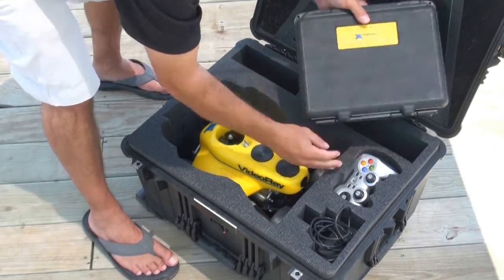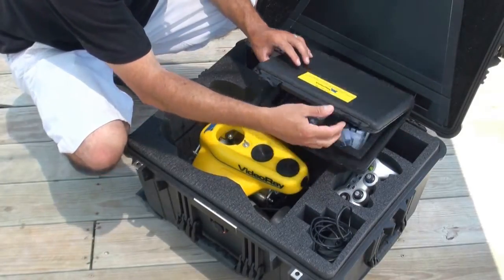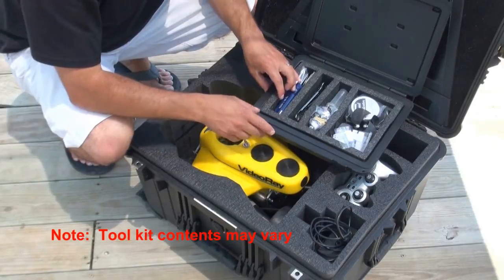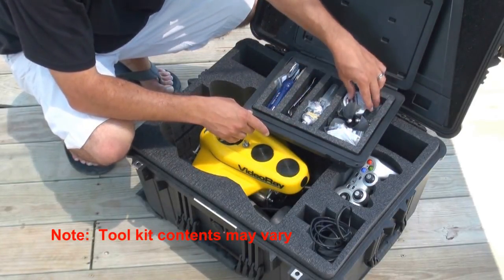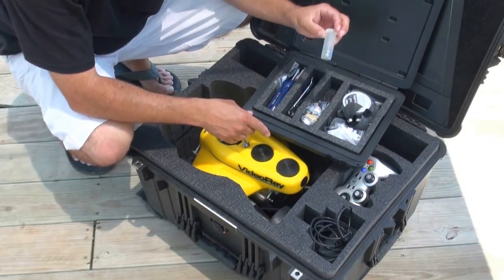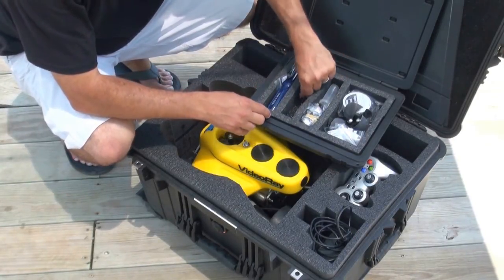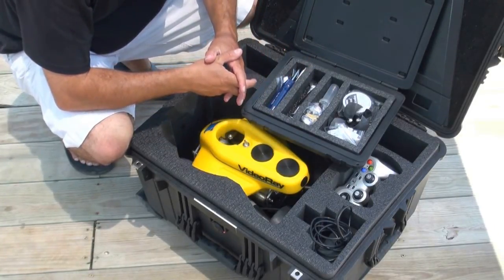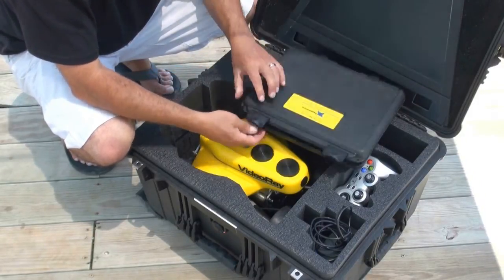In the back here, you're going to find the basic tool kit that comes with the ROV. Inside, you're going to have everything you need to perform field maintenance on the fly — quick simple maintenance for the sub. You're going to see a couple of spare propellers, some speed lube for your O-rings as well as an O-ring replacement kit, an extra cartridge seal — we'll talk about cartridge seals in a little bit — some wrenches and a 10-in-1 tool with a nut driver and Phillips and flat heads so you can get into all the screws and remove those if you need to. Basic tool kit in the back.